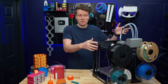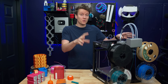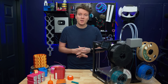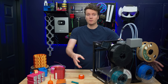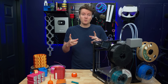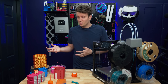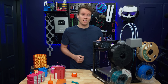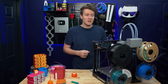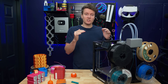One question you might have is: why would you want a multi-material printer if you're rarely going to print multi-material objects? There are three big reasons I like multi-material printers even if I'm not printing multi-material. The first is automatic color switching — say I want to print in blue, I put two blue spools in, and if one filament runs out it'll automatically switch to the next one, using pretty much all of a spool before moving on. The second is how easy it is to change filaments — when you're done with a filament you just pull it out because it automatically cuts the ends. I change filaments fairly often, and the older manual method of retracting, heating, extruding, and manually changing is just more tedious. This is super easy and way faster.